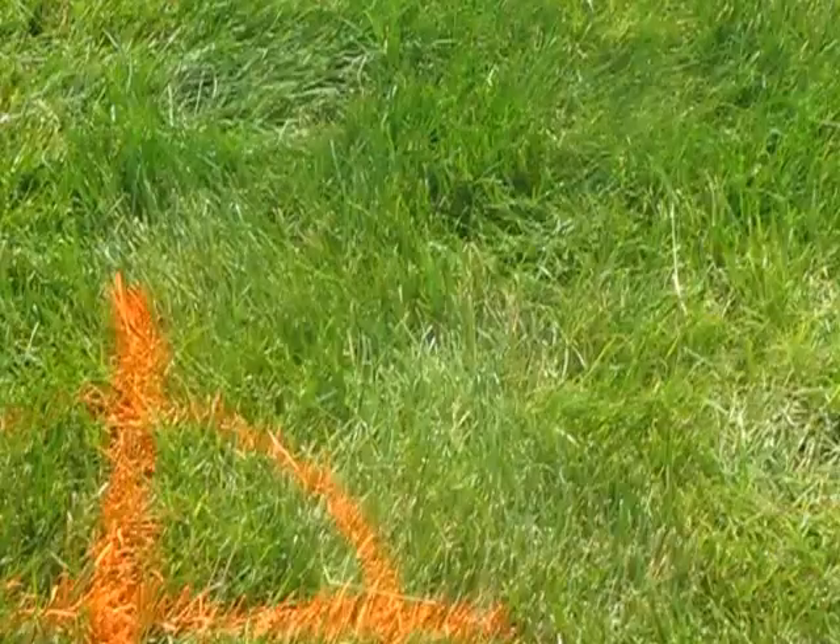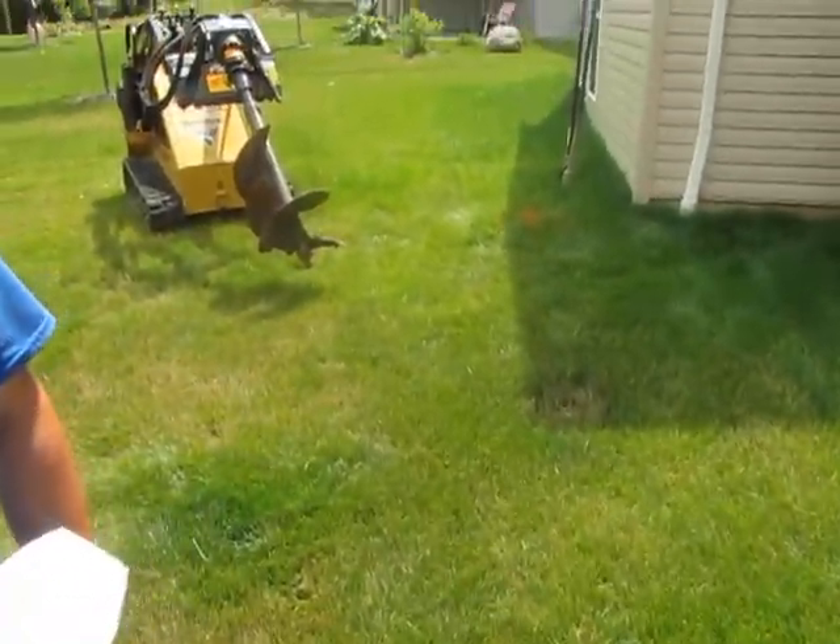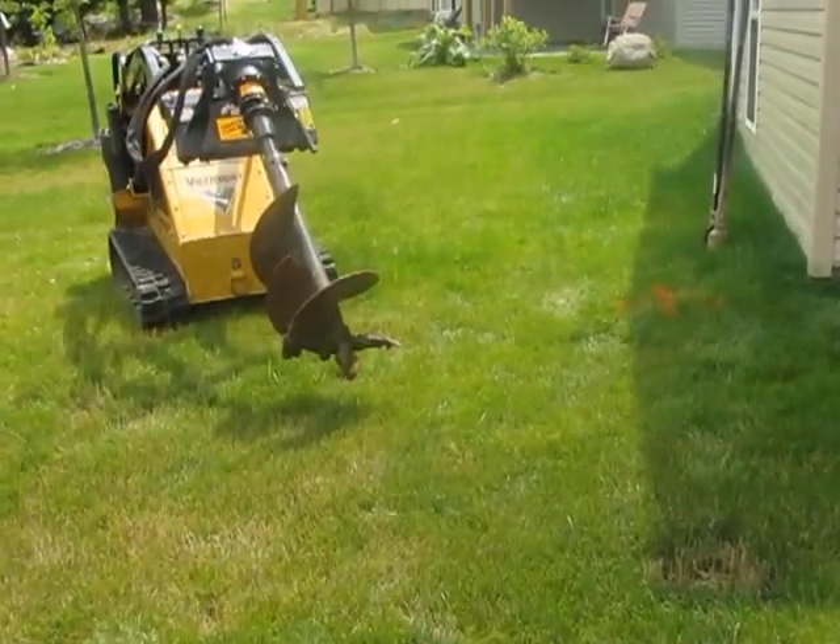Being Strongsville City Code, it's a 16-inch diameter hole, 42 inches deep. So we use our auger machine today to dig those holes, clean them out, and make sure we have the nice depth and stay within city code. Thanks for watching our video. We hope this helps you out.